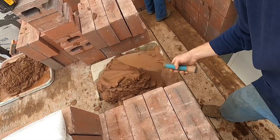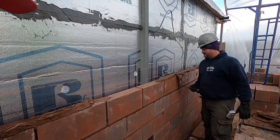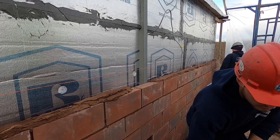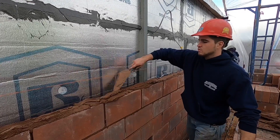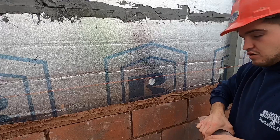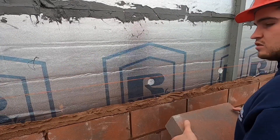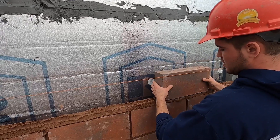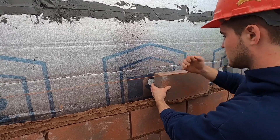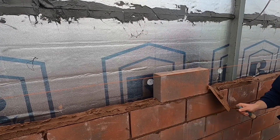I usually make a space to roll my mud, grab a scoop — whoop. When you roll it you can go farther when you're spreading. You can lay it like this, or grab it one side like that, set it on your wall, matching your bond. Keep it rolled away and then bring it into your line, tap it, and keep that trowel-length away from the line. That's it. Cut away your mud, next block.